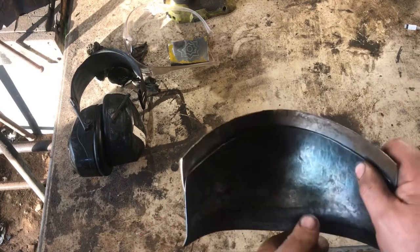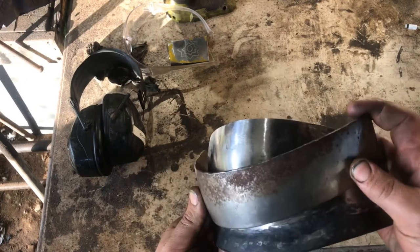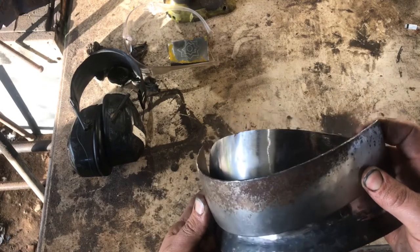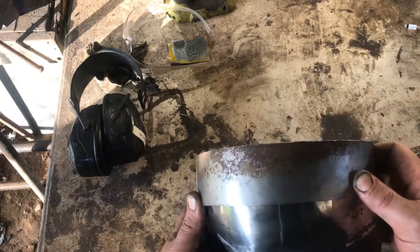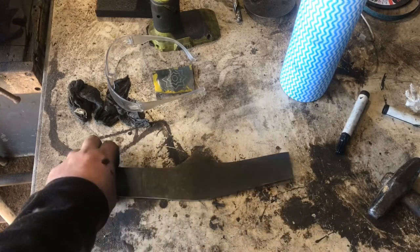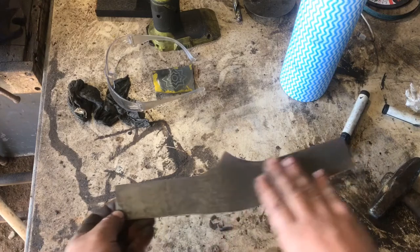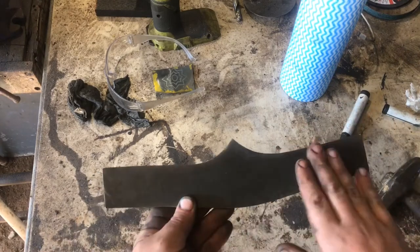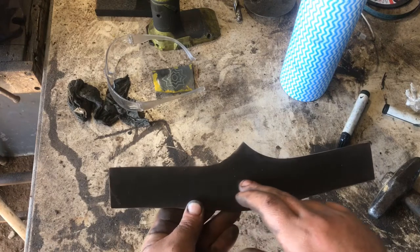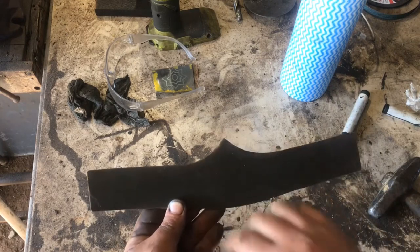The whole idea of this lame here is so it can drop down just to help with breathing between the fights and the battles. I have my pattern here — what we're going to do is give it a light dish through the whole lot, then put a flute through the middle here and have this angled back towards the top of the helmet.